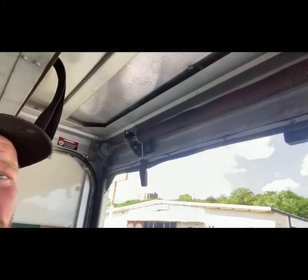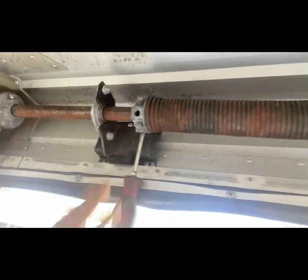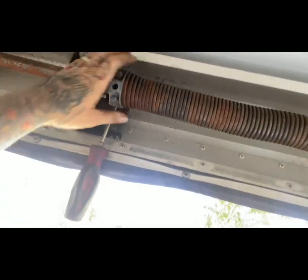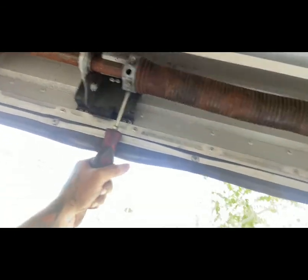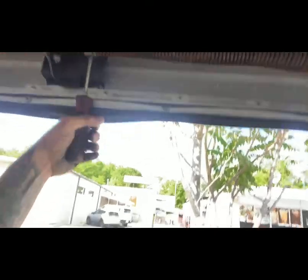We're back with the video. Here's what I did — I went ahead and sprung this thing. As you can see, it's kind of angled now because I pulled it all the way over. You see, there's no rust showing now — I actually pulled it a little bit further than it was. Once I got it loaded on the four turns, I stuck my screwdriver in here and just let it hold it so I could tighten both jam nuts. You can wiggle your screwdriver out.